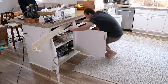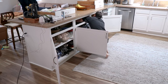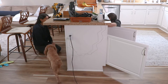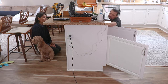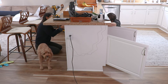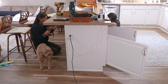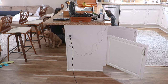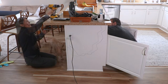I get the support piece all ready and then enlisted the wife to help hold it in place - it made it a lot easier than rigging something up myself. And of course Bob Barker supervised the whole time. Because we're going to be repainting these cabinets, we just go ahead and screw straight through the back into those support pieces, and afterwards I use some epoxy putty to fill up the holes, sand it down, and you'll never even know it was screwed in.